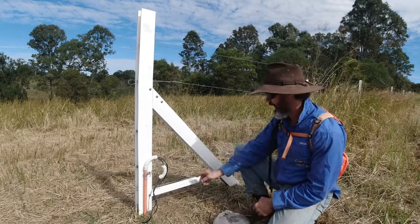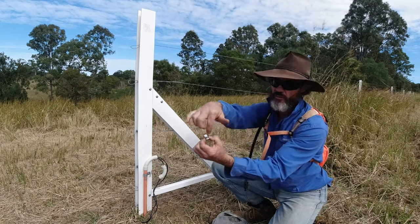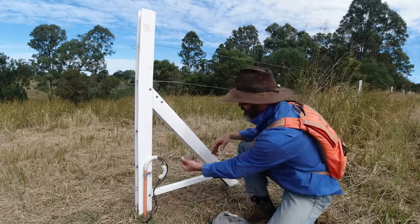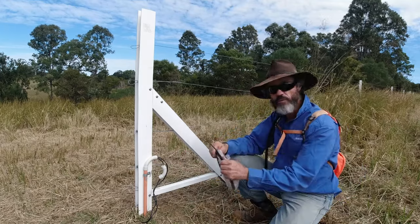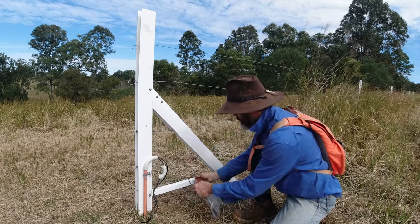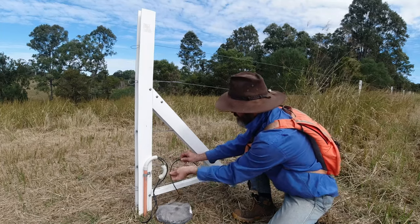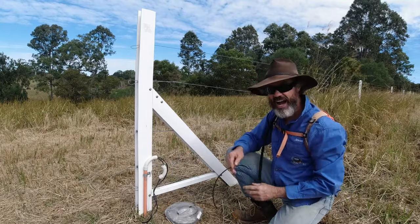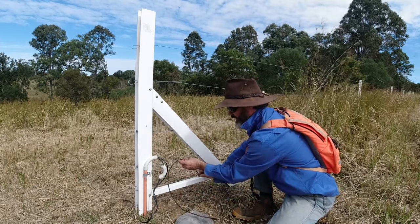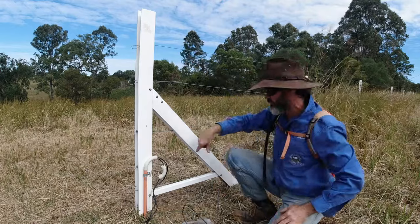When it comes to jumping the hot wire cable from wire to wire there's multiple methods you can use. My preferred method is just a split bolt. As you can see, that split bolt has got a slot in that bolt and you just put the wires through both sides and screw down - it's got a locking collar inside. Screw down on that and that tightens it onto the wire. When it comes to the jumper wire itself there's two ways you can do it. There's an easy way which is to cut a single wire and join it to one wire, measure it, strip the other end and join it to that wire, then cut a separate piece to go from there up to there - they're all separate pieces. Or the hard method is if you want a single wire, you cut it there and you cut an inch strip in the middle and take that off, then go up to the next and do the same - cut an inch strip, and vice versa all the way up. That way it's continuous all the way up.